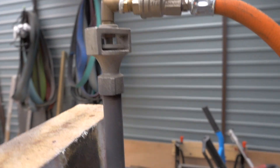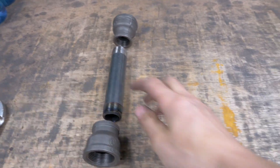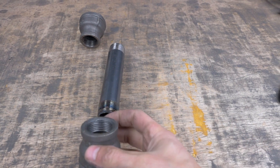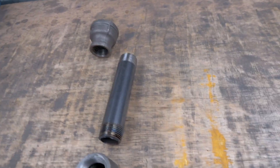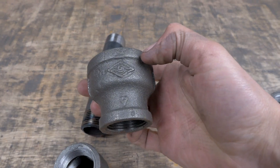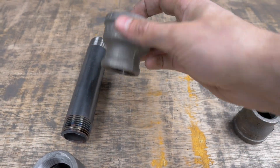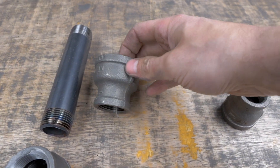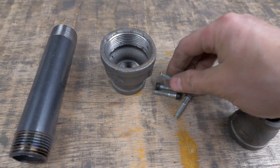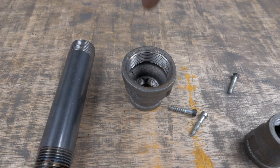There are a number of videos on the internet about making similar burners, and it's your choice whether you make your own or purchase them, but let me show you my ideas. So this is nipple pipe — a piece of one inch nipple pipe. This is one and a half inch to one inch, which will become our flare. We can have a bigger one or a smaller one, but they'll both connect onto one inch. We then have another one — I think it's one and a half inch flare — again pipe that you can use on the top. The idea I've seen for this is to drill four holes inside of this, tap those, and then use M5 bolts to go through into the flare and hold a particular unit which can then direct the flame down.